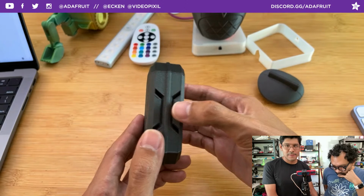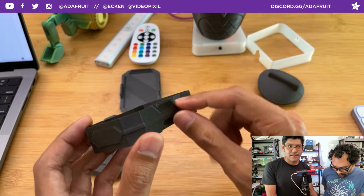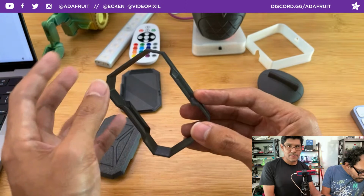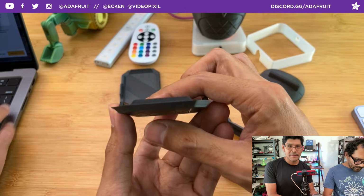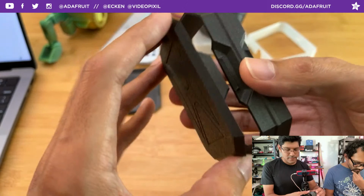The covers are symmetrical. What's interesting is you can press in the center here and just pop it out. You'll notice that the snap fit nubbins, normally on the inside of the framing, are on the outside of the framing in this case. I have these cool drafted angles, and the shell follows the contour of those drafted angles. The covers themselves have tabs on the outside, and the tabs have nubs. It's a little different than the chevron-shaped grabbers. They're just these nubs, so when you press fit them together, they click in that way.